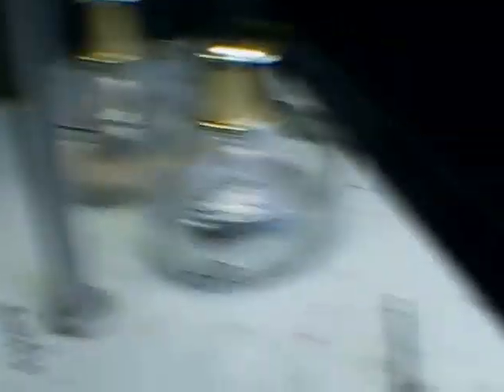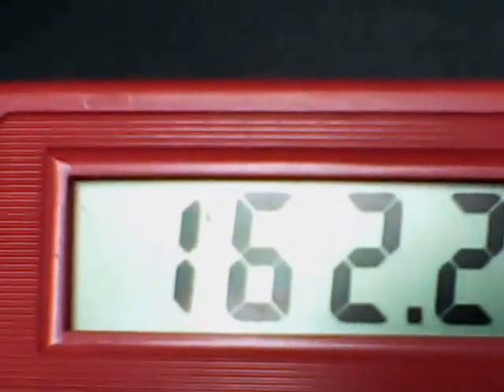We're at about 80 degrees right now, heating this. I've got a thermometer immersed in it. I have a little cooling device — an aluminum block from a circuit board — and the thermoelectric generator is sitting on that with a pan of ice. We're at 1.07 volts open voltage, going up steadily to 1.10. Short circuit gives us 165 milliamps.